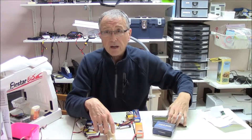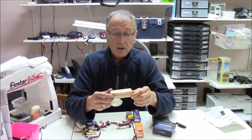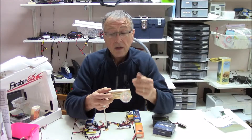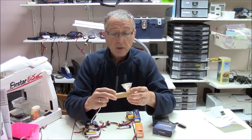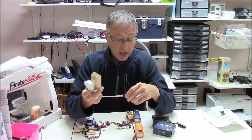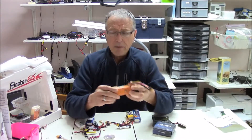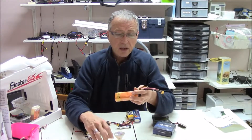I know from Experimental Airlines they did a short video on how to calculate internal resistance by measuring the unloaded voltage minus the loaded voltage, divided by the amps times a thousand, which gives you the milliohms — using a light and then measuring the voltage after there was a load on your battery. But it took quite a bit of time to set it up and do the calculations.